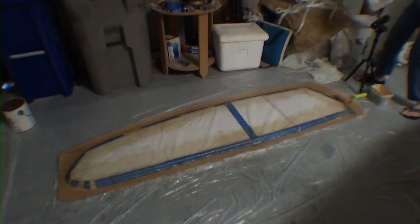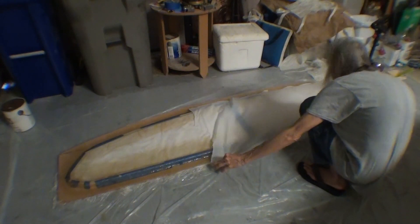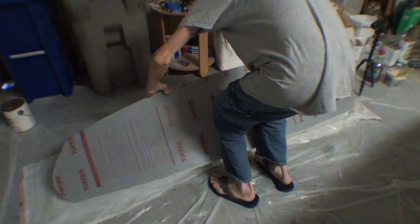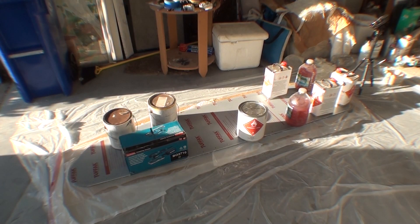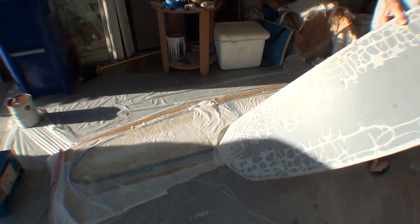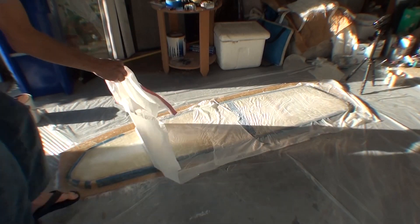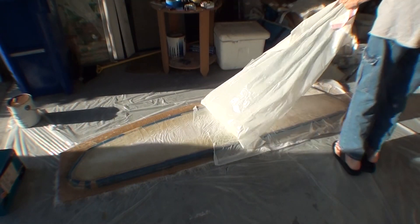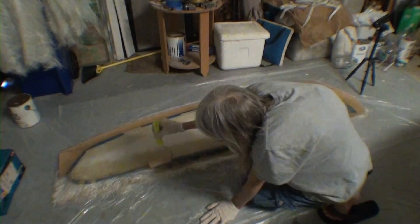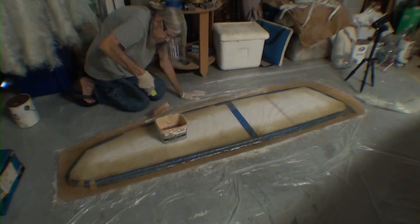I'm about to make a mistake here. I don't like the way the fiberglass is following some of the ripples in the plastic. I used some trash bags as a release layer, and I thought the window would be the perfect thing to lay there and smush all of that flat — which it did. But the chemicals from the resin actually went through the trash bag and affected that protective layer on the window and also affected the plastic of the window just a little bit. So I definitely don't want to do that again next time.